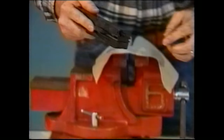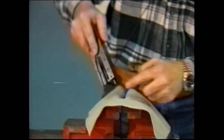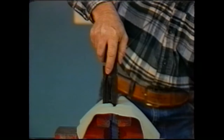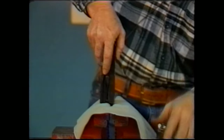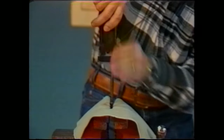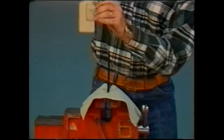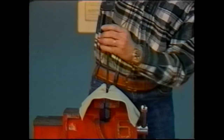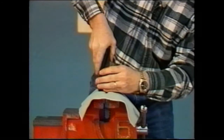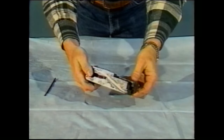What you'd want to do is place the end of the driving rod into the jaws of a vise. Make sure that the bolt is not fully seated, but protrudes a little bit. Tighten it up. And then you can press down on the bolt body, rotate it 90 degrees, and very carefully withdraw the bolt. And that completely removes the likelihood of the driving rod spring flying loose and striking you. Assembly is the opposite procedure, and once again, is greatly simplified with the use of a vise. It's a 90 degree movement. Very safe.